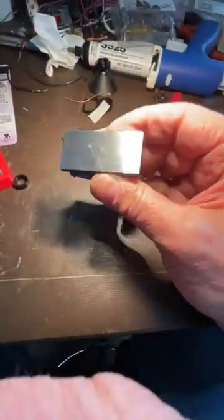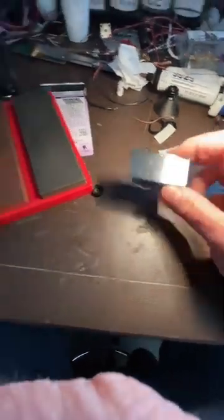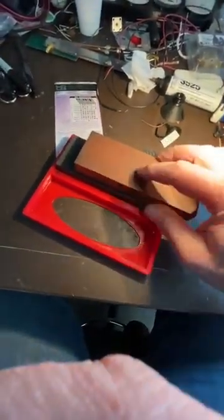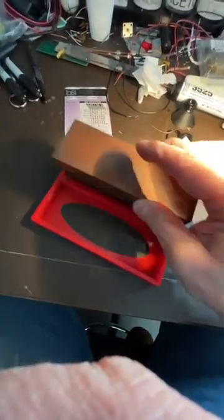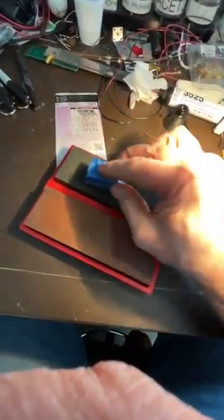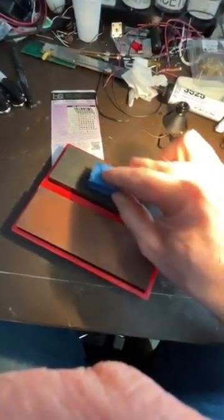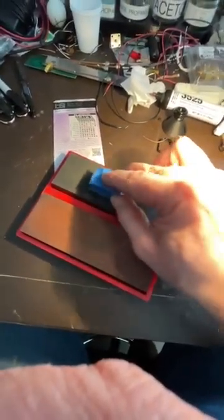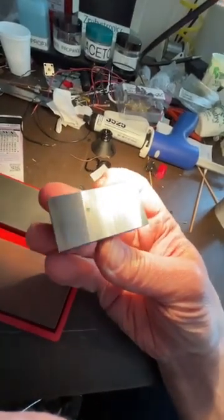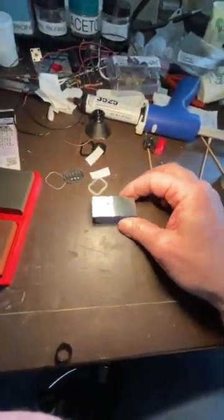And this is the setup, right? Go back to the camera here. We just have the block sitting here, and we have a ring light, and that's it. And when I say that we use the PFG stones on this block, we take the 2 stones and we condition them against each other. And then we just bring the block in, make sure there's no grit on it, and we'll just do that. Now I'm pushing down like 5 pounds. This is not like a little bit. This is lots of pressure, and there you go. And then we put that under the microscope,